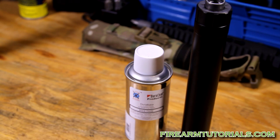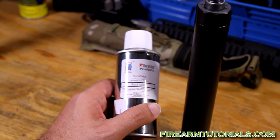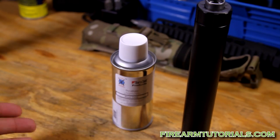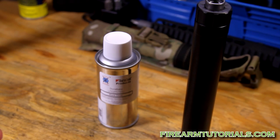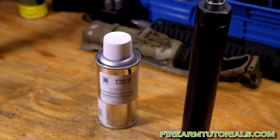The Dura Bake is probably the most efficient way to do this. Is it the best coating? Probably not — Cerakote would be better, but that requires a significant investment: a large air compressor, blasting cabinet, media, and spray gun. With Dura Bake you don't have to mix any chemicals, don't have to buy anything else — just this aerosol can and an oven. There is another newer product where you push a button on the bottom to release the hardener into the can, shake it up, and use it. The problem with that is you need to mix it very well, and there's a limited window to use the whole can before the hardener ruins the remaining paint. With Dura Bake, you can paint whenever, keep it on the shelf, and all the hardening work is done by the oven.